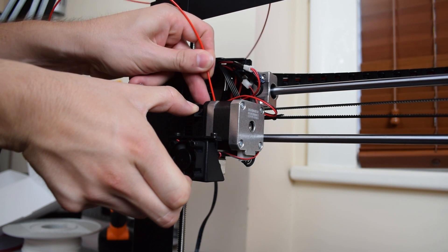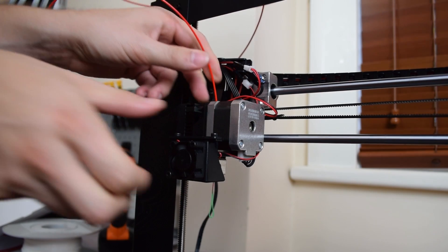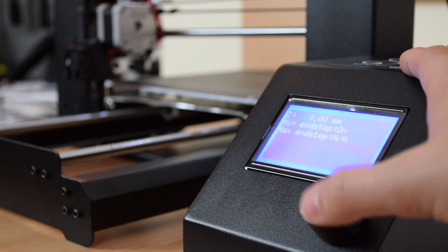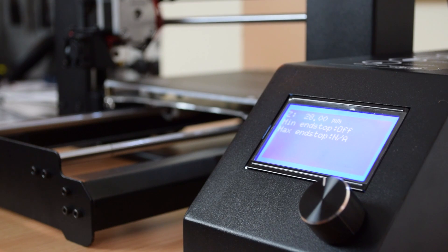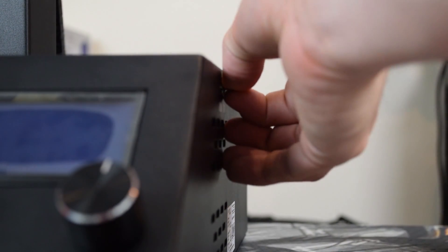There are no cartridges — you can fit any type of filament you like as long as it's 1.75mm diameter. It also has an LCD screen with a dial to set your temperatures and movements directly on the machine, and it's controlled either via the included USB cable or via micro SD card. You can load your G-code using a variety of slicing programs.